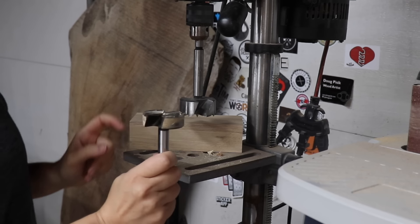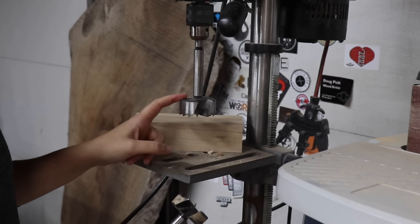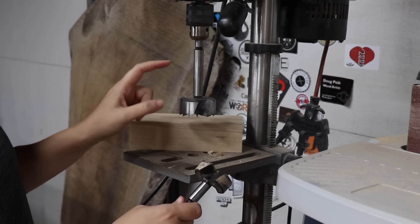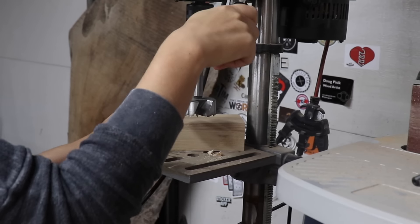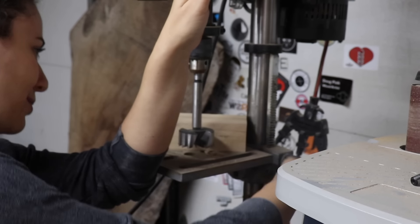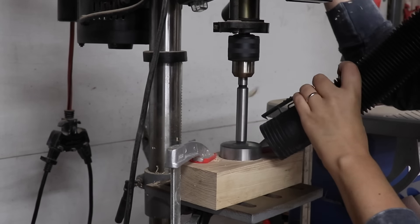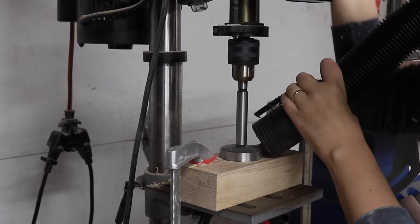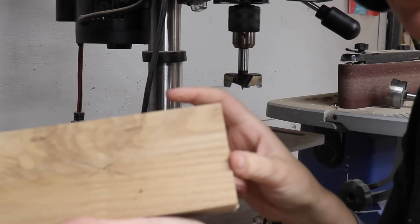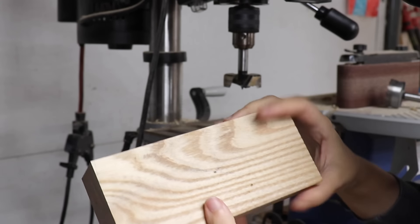In order to get the two-inch dowels I need to make a larger hole than two inches to be able to put in the rough stock. I have a two-and-a-quarter-inch bit and I'm going to set the depth on the drill press so it drills about halfway through. Then I swap to the two-inch bit, mark the center of the board on the other side, and drill straight through.